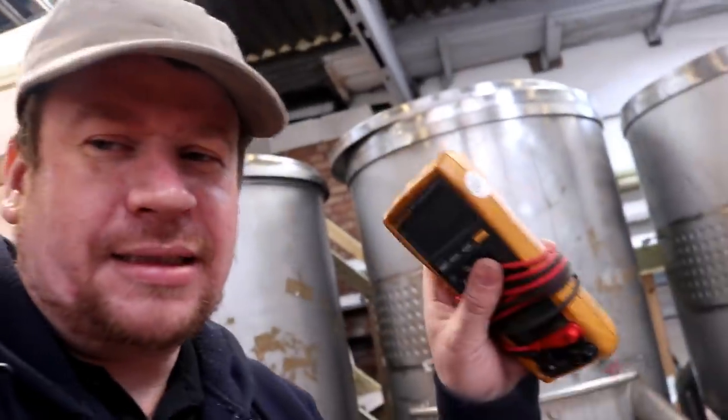So I've just been out to the car and I've just tested the battery with a multimeter. We're sitting at 12.7 volts today. I started the engine and checked the voltage with the alternator running, and it came in at 14.3 volts. So I think the alternator is good, but the battery's dropping charge slightly, so maybe there's a load of crystallization over the lead plates or something like that causing that to happen.